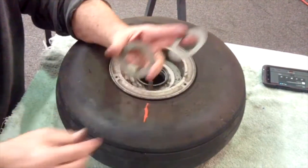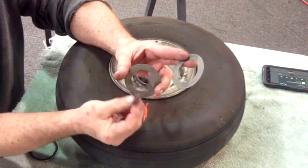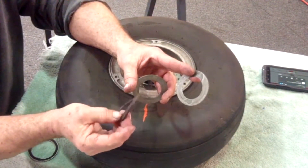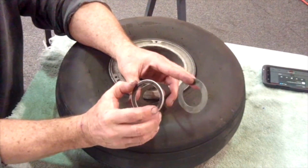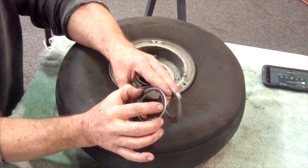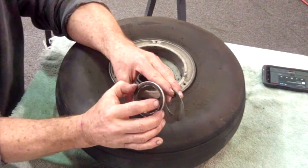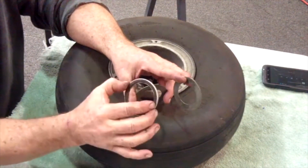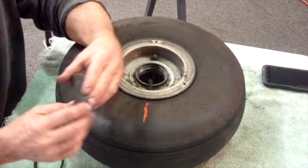Now let's talk about the seals. On the backside we have two ring seals with a piece of felt seal in between them, and a snap ring that holds it all in. On the front side we have something very similar: a cup ring with a piece of felt inside it — this is the one you want to stretch out when you're greasing it, as it tends to get long and can be hard to get back into that little cone. Then you have another clip ring. Those are the inboard and outboard pieces that go with all the main halves — stack them all up and make sure they're greased.